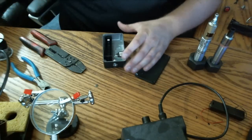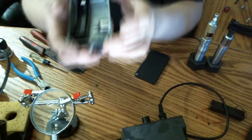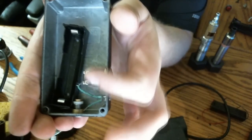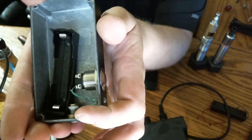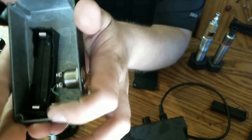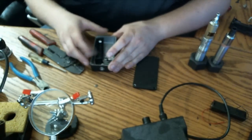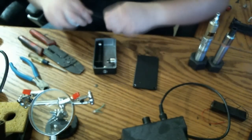Yeah, you can kind of see my LED is just going to reach just perfect to make it to that 510 connector to ground. So coming perfectly off the switch here through the resistor to the LED, and then the ground connecting to the 510. Now the 510 is going to be grounded because I'm going to connect the other lead of the wire and solder it on the other side of this locking washer that's on the 510 connector.